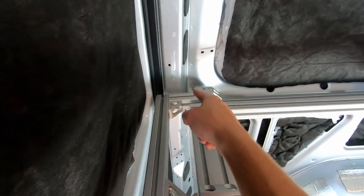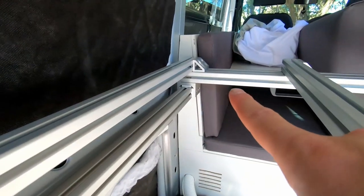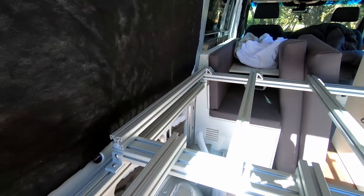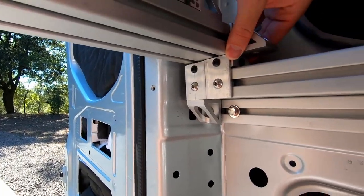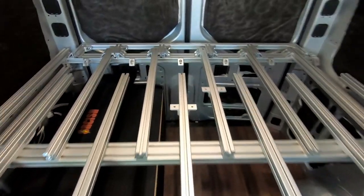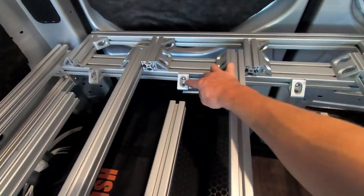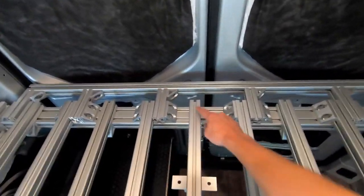You can see on the back portion I used as much space as possible, extending the head space into the area of the rear doors. One of the most challenging parts of this design is that the linear bearings have 3/8 of an inch between the two crossbars, and none of the 8020 parts are designed to support those additional 3/8 of an inch. That required cutting little 3/8-inch pieces here and there with some awkward attachments, and rippling that adjustment throughout the whole system. As you slide the bed frame back, the sides are no longer supported — the solution is these little ski jumps that intercept the sagging unsupported ends of the extrusions and push them up onto the back crossbar.